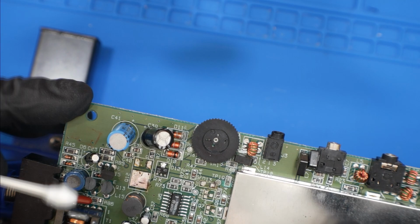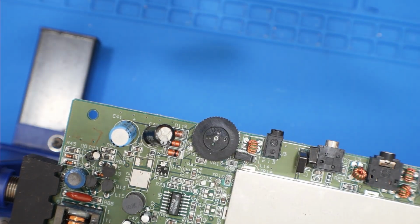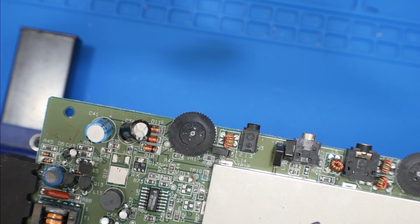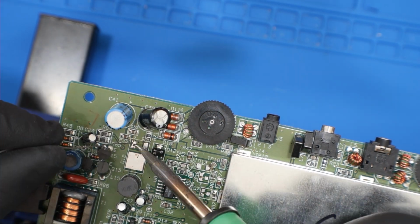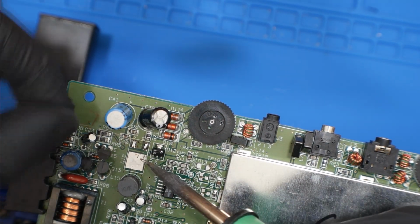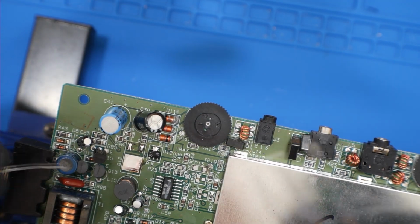Make sure you clean as you go. It'll make your life a little bit easier. Just, Q-tip, some rubbing alcohol, not rubbing alcohol, but 99% isopropyl alcohol. But as you see here, we'll just put some fresh flux on there and just add some fresh solder to these pads so we can get ready for it to put the new components on there.